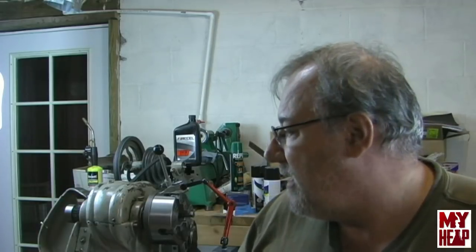So other than that, I need to thank Mr. Pete 222 on his videos on doing a backplate for a chuck. And there are a number of other guys out there that have shown how to do backplates. Without their videos and without me having the opportunity to see them, it would have been that much harder for me. I think I worried more about it than I really needed to. It seemed like a pretty simple process. I did cut on the lowest speed. I used a brazed carbide tool, the same one I was doing my test cuts with. I think it cut just beautifully. Very, very nice finish on there, and it fit with no play.